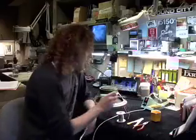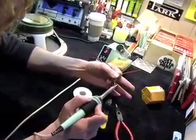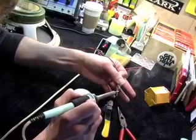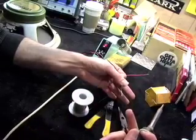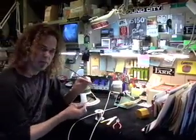Now I'm going to get my soldering iron and clean the tip. I'm going to put a little bit of solder on it just so it has some heat going — just flow it on. I'm going to lay the wire against the solder and bring the tip in, and just flow some solder on there. See how it's flowing? It's not a lot, just enough to give it some solder inside the wrap. I'm going to do the same thing with the red one. Now you have two nicely prepped conductors.